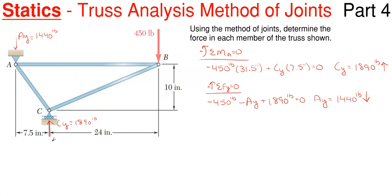At this point you can just pick a node or a joint and start there. Typically the best points to start solving your trusses are at the reaction points, because you have a lot more information there. If you start with a joint and can't solve for anything, just move on to a different joint — it doesn't mean you're doing the process wrong. Sometimes you just have to joint-hop; no big deal.